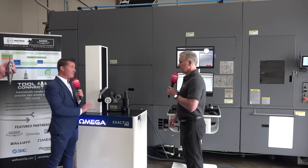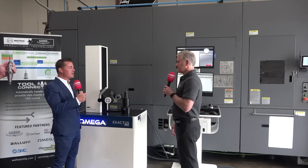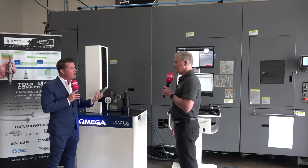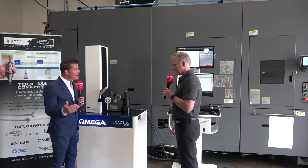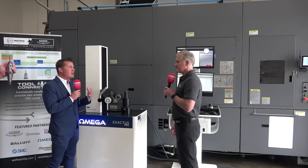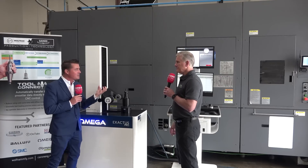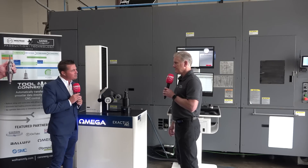Rob, you answered pretty much every question I wanted to ask, which is amazing — because I was going to ask about the RFID chip, whether it's only length and height, but you mentioned it's going to be weight and so much more. It's always going to be there to, as we always do with care and engineering, remove that operator error. How many times do we make mistakes — pop something in that's too large for a holder or needs to spin faster? It's not just length and diameter like it used to be when I manually plugged it in. This is a full database of information on a chip that keeps a solid account of what's going on with that specific tool.